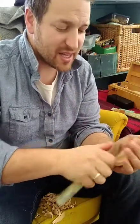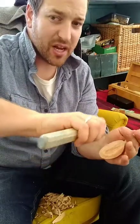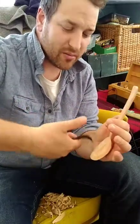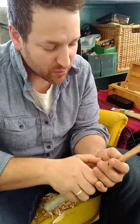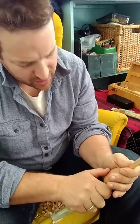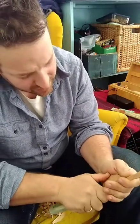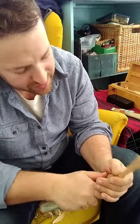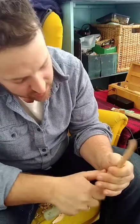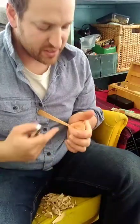That's the cut that does this roughing work. As I go further along you'll see sweeping cuts where I'm holding the knife still, keeping my thumb out of the way, and pulling it around — those are more finishing-style cuts. The first motion is the roughing-out cut where you're hogging out material using a fair amount of force. Until you're comfortable with what your knife can do, start slow, take little nibbles, and gradually see whether you can get larger pieces off.